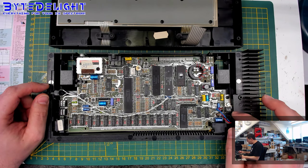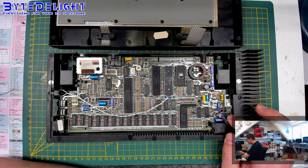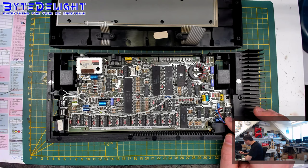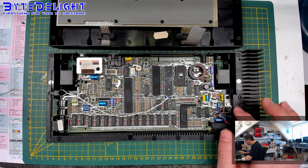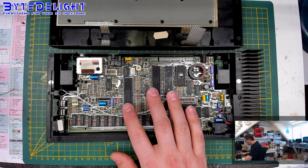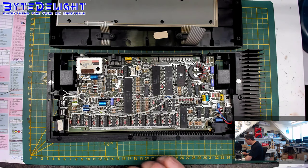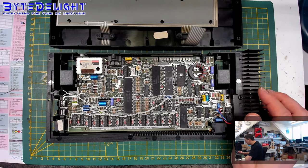The last thing for now is this voltage regulator, which is a 7805, a 5-volt regulator. This should be a 2-ampere one. I'm not sure if this exact type is a 2-ampere one. Maybe it has been replaced already. So I think it's good to replace it again, or I should look up this type. Maybe it's a 2-ampere one, because the toastrack itself uses 0.8 amperes when nothing is connected, so that's important.